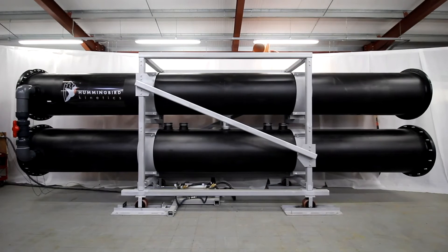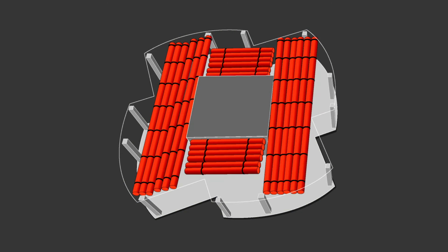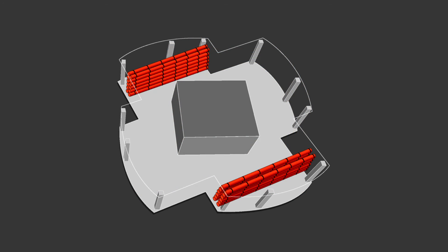The Hummingbird is another variation on a liquid damper, based closely on an older style called the tuned liquid column damper. Hummingbirds are long cylinders of water. What makes the Hummingbird more interesting than other damper types is that, although it's also water-based, it doesn't require that very large contiguous rectangular space at the top of the building. In fact, the Hummingbird is so adaptable that we can position it in floors above amenity spaces, between pieces of equipment, and really shoehorn it into the available space at the top of the building.